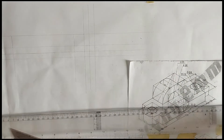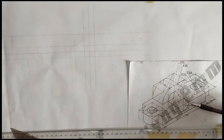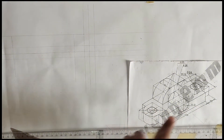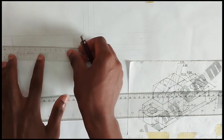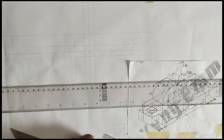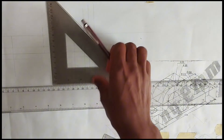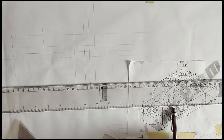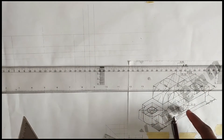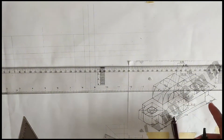As we can see in this place there is a circle, and this circle is actually in the middle of this 160 millimeters. So we are going to be looking for the middle of 160 millimeters, which is 80 millimeters. From that 80 millimeter point we are going to draw a center line — we are not going to be using a main line for this particular place. From this center point, the radius of this circle is 15 millimeters, so the diameter is going to be 30 millimeters.